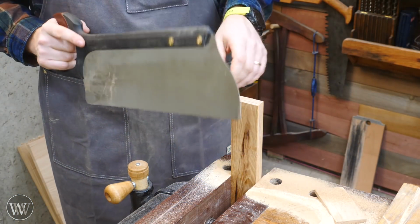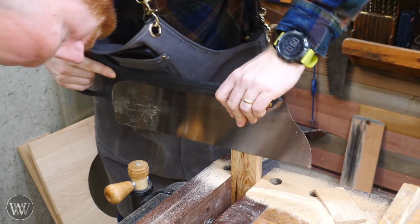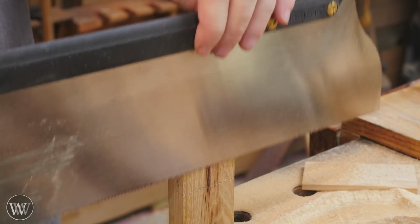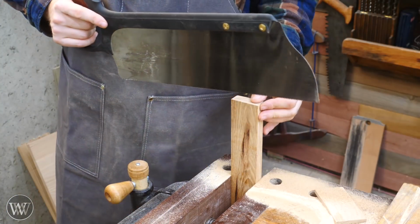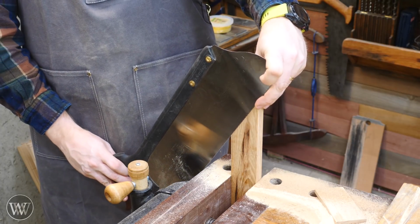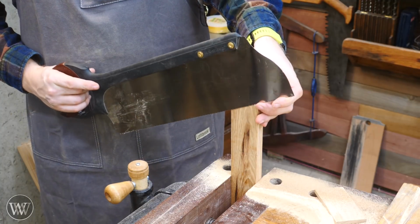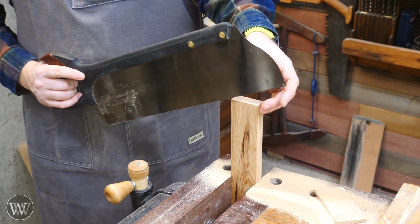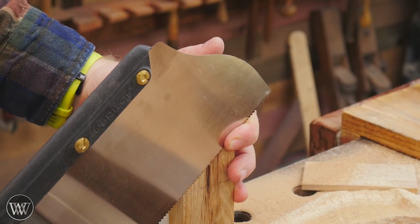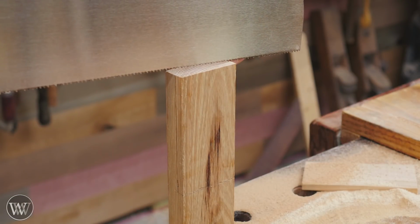Now this cut is going to feel very much like the last cheek cut, except it's a little bit deeper. This one actually goes in 4 inches, and that happens to be just about the depth of my tenon saw, which is kind of nice. So I'm just going to let this run down until I hit the back here, which is my depth. The only other issue is if I were to do this the same way, my first cut would be at this crazy extreme angle, and I'd be all the way down laying on the floor in order to make that. So I'm going to actually cut down about this far. Then I'm going to rotate the board around and cut down about this far, and then I'll rotate the board around, then I'll cut down there, and then I'll rotate it again and cut all the way down to depth. So we kind of go back and forth rather than just making it all in 2 sides.